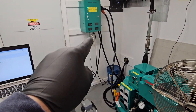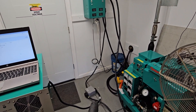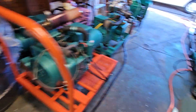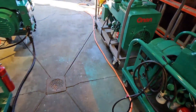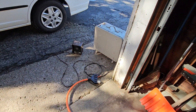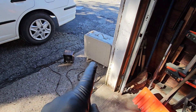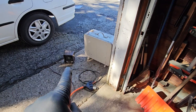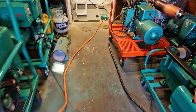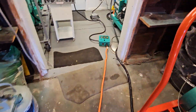Of course, that wire goes up there. There's meters on there to monitor the load, and that goes to this load bank. I got my old-fashioned load banks out here, which are nothing more than portable electric heaters. So I should be getting about 1,800 watts out of this and about 1,200 from another. We're going to be capable of pushing close to 15 kilowatts.